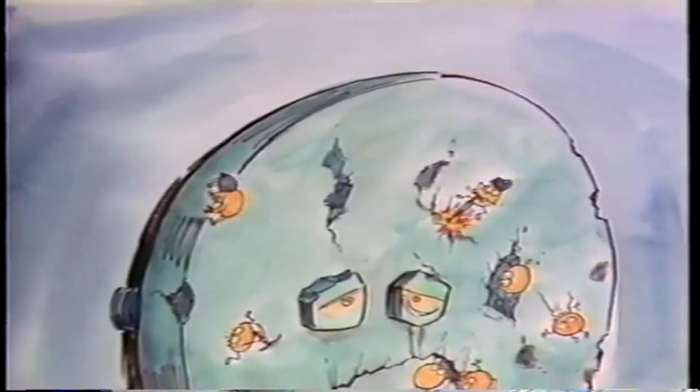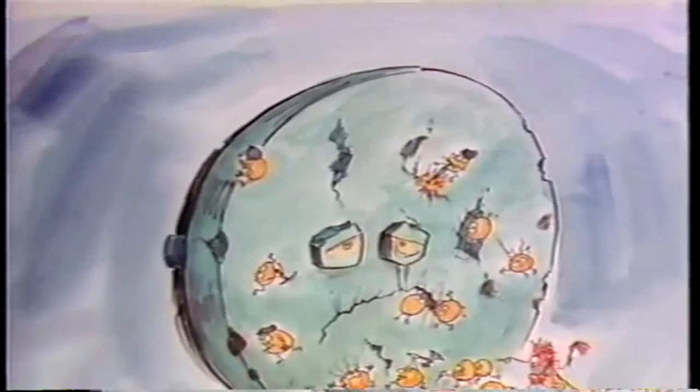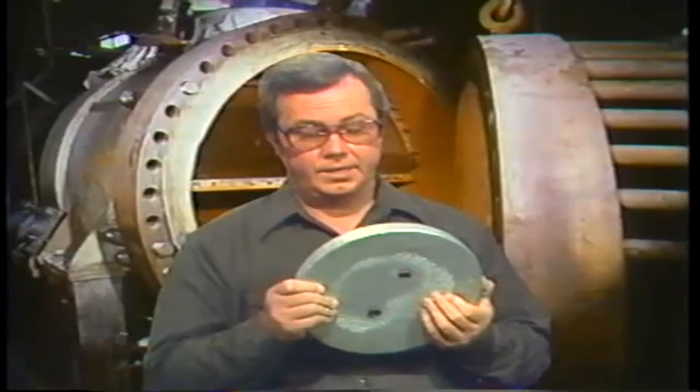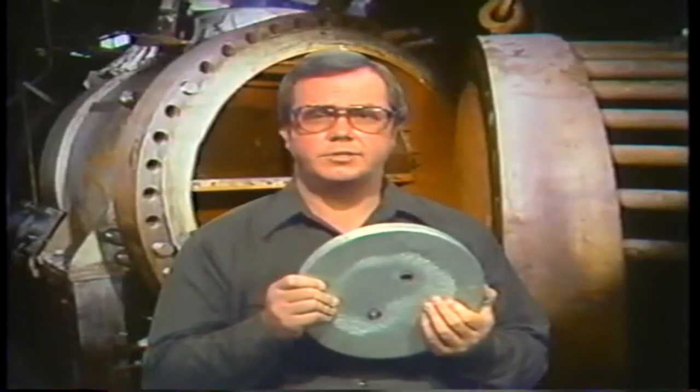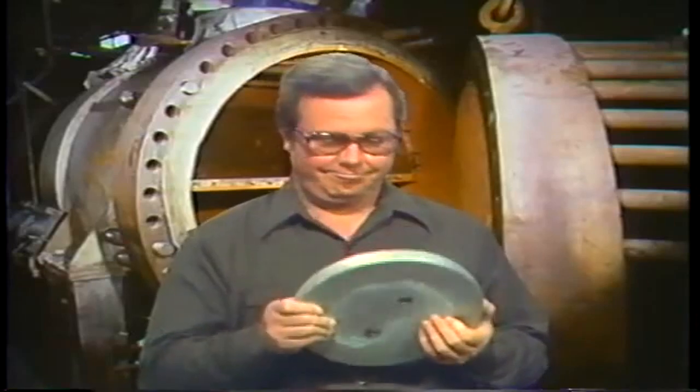But one rule of thumb is to replace them when they're more than 50% eaten away, or when they are in danger of coming loose from their mountings. Replacement is a straightforward job of just bolting a new one in the place of the old one, and you're done.